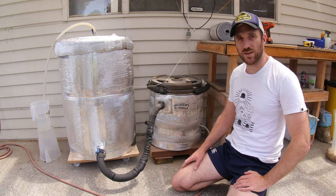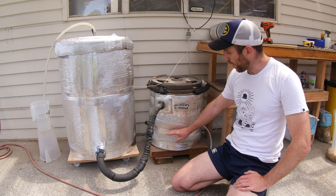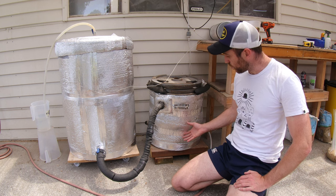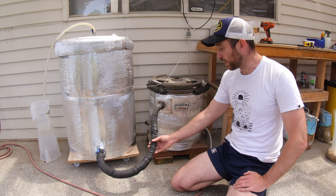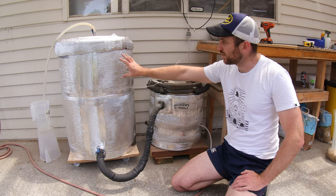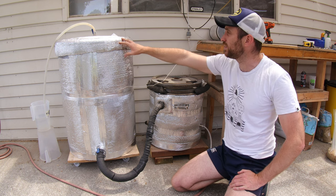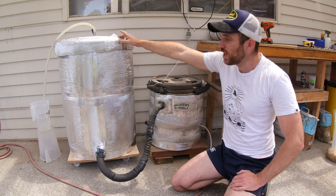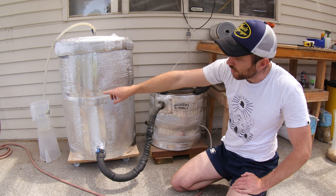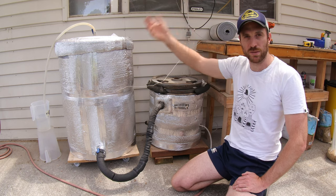This system is currently in operation which means the water in here is sitting just below boiling, about 98-99 degrees. Every time the PID cycles on it boils the water, the steam gets pumped down this hose and into my steam tank. It heats the substrate up to 95 degrees and any excess pressure gets vented out the top through that pipe, which runs down into a container with water to condense the steam back into water so I don't have steam blowing around the place.